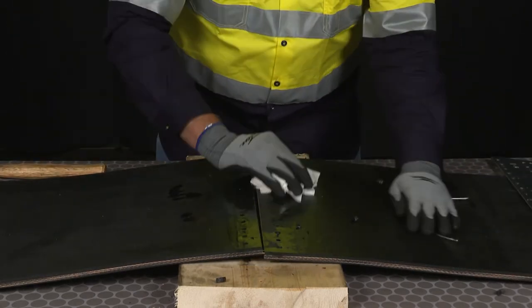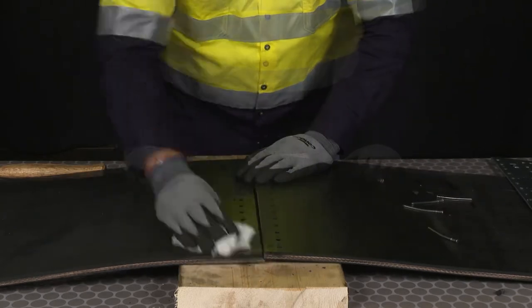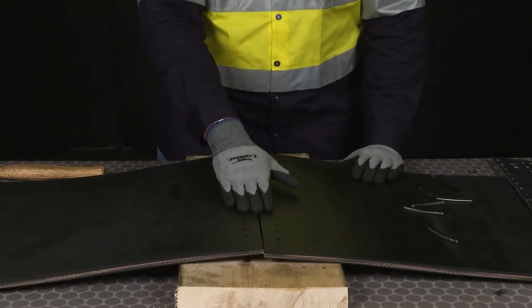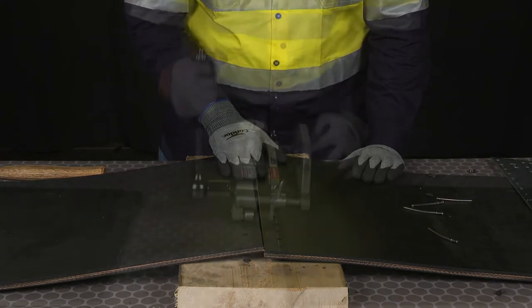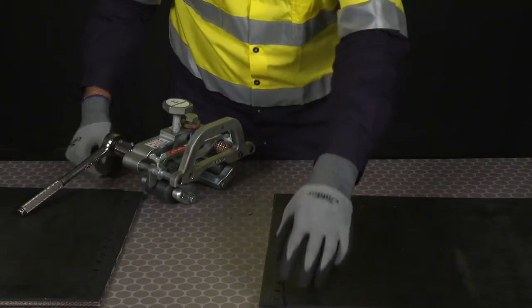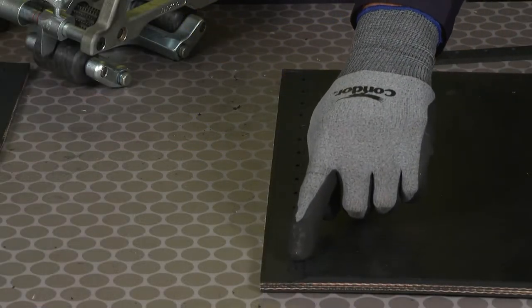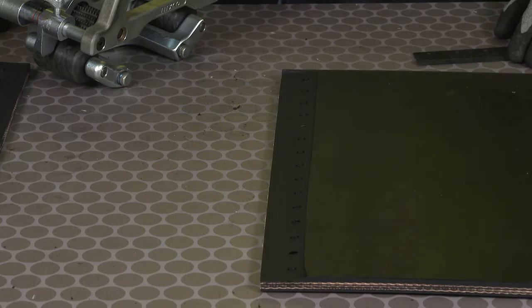and we're going to wipe the belt down so it's easier to skive. The reason why we didn't skive first is because we needed a flat surface for the placement of that template while punching the holes. The benefit of skiving the belt is to countersink the splice for improved cleaner compatibility.